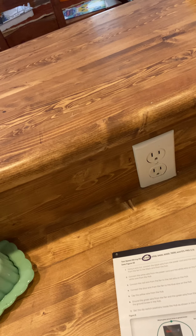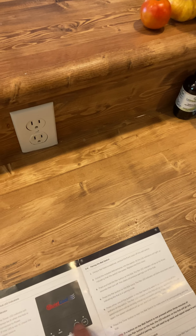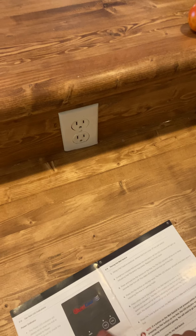This is all done in the attic. If and when in doubt you mess up, all four indicator lights will stay on — that means you need to redo it. Disconnect your power. For me it was pulling out a wire from the pigtail, putting it back in, making sure dip switch number two was up, then put it back together and it was perfectly on.